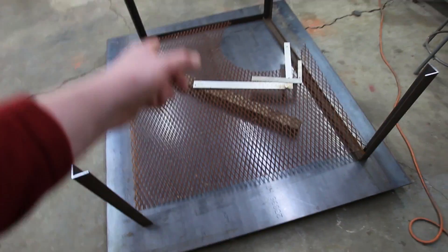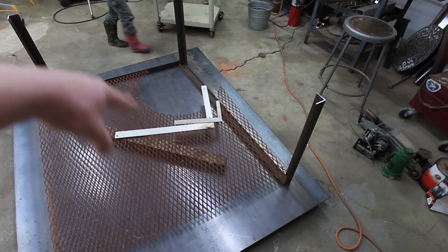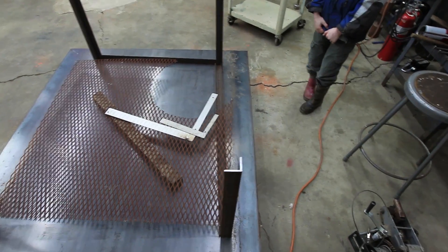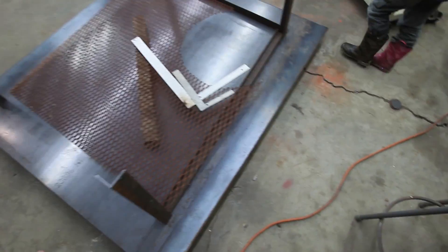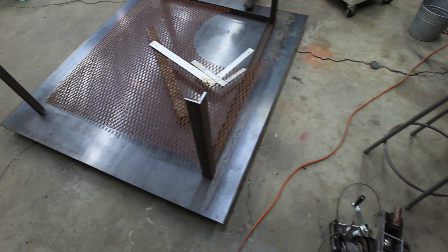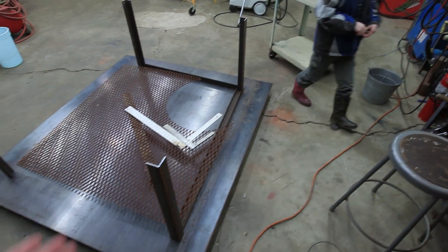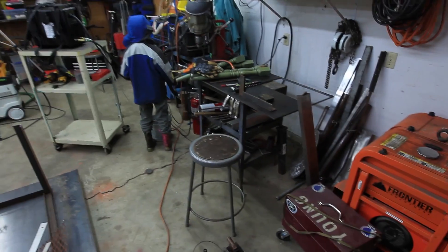I can just set scraps, cutoffs, and things like that on the shelf. Then I'm leaving the other half open so I can sit at it with a stool and have my legs underneath it and get comfortable. I have a leftover piece of inch c-channel that's going to reinforce it, since this is three-eighths and there is some flex to it — if you stand on it you can kind of watch it flex. So I'm going to run some angle as a framework around it to eliminate the flex. I'm not doing super precision work, so I'm not too worried about it.